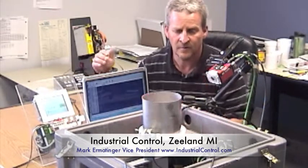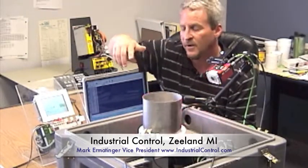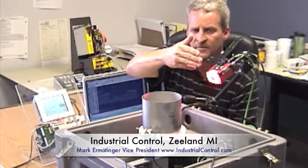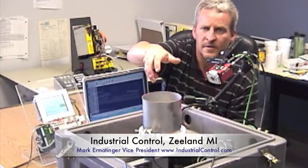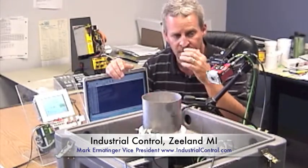I let this test run overnight. We had about 130,000 turns on this servo table and we had about 135,000 reads with the Microscan QXHawk. What that tells me is that as the can is spinning around, I'm actually getting a couple of reads because I have a dual core processor inside, so it can multitask. The QXHawk is set up to take a rapid capture — taking multiple images and processing them after the fact — so when the barcode comes into the field of view I'm getting several reads, which explains the extra 5,000 reads over our revolution count.